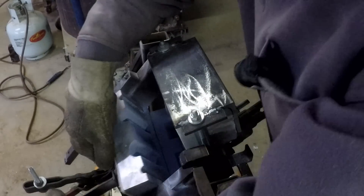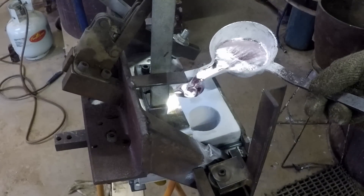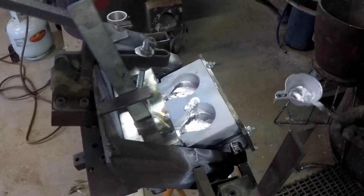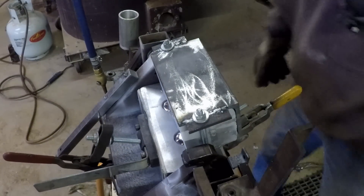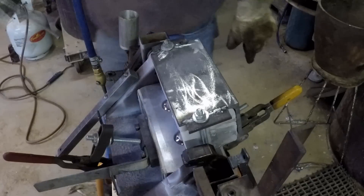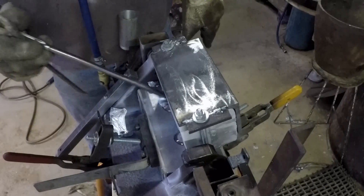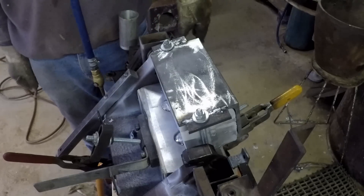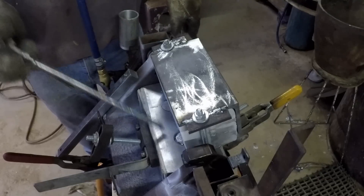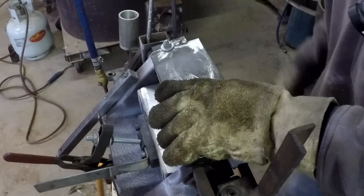I think we've got a die up and running and producing nice castings. This time the basin's a better size — last time they were a bit big and I couldn't fill them as high as I wanted to. This time when I fill them, the metal is running about halfway up into the feeders before I tilt back, and now I've got it right to the top. That's about ideal I think. They're going solid much quicker than last time, so this should be a quicker run — that's what we want.